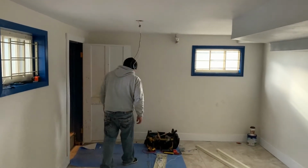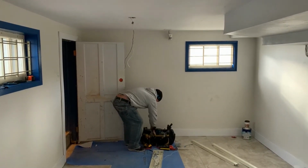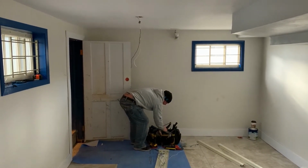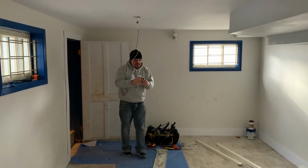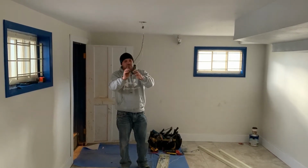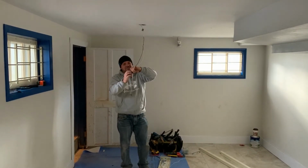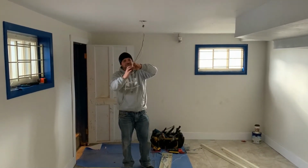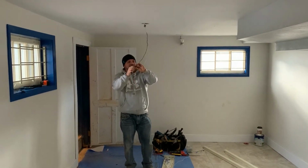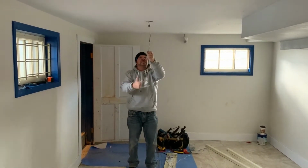And just where we're dealing with old wiring, I'm going to put some electrical tape on it. Oh, there's some. Just going to tape my ends up just to be sure in case somebody flicks the switch on while we're working at it. Really, we should shut the breaker off, but this is an office building, so it's kind of hard to shut the power off when they're upstairs working in the offices. We don't want to kill computers. They don't like that.